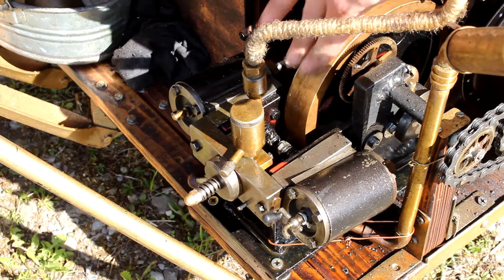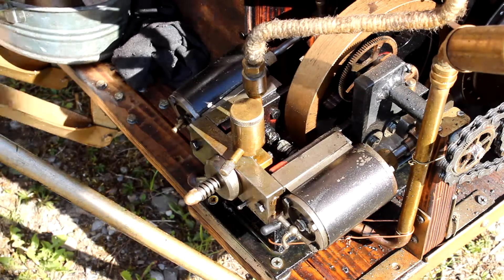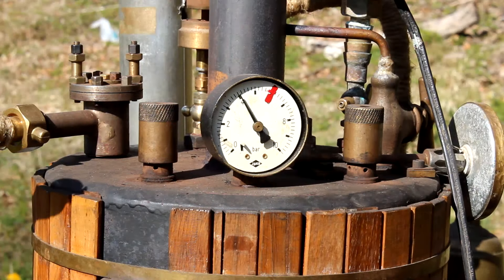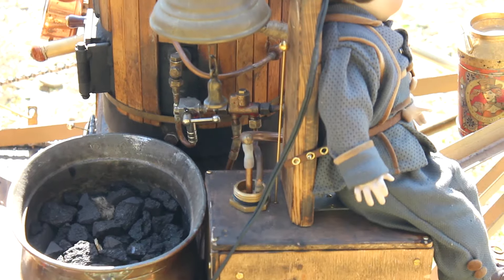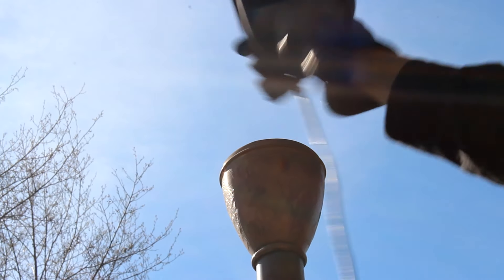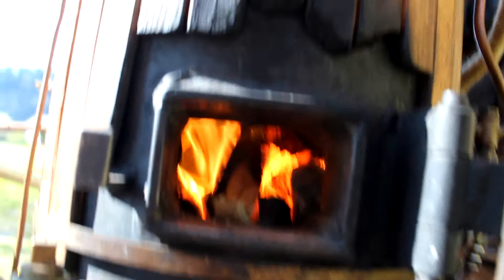Here we have two oscillating cylinders. The pistons get steam from the boiler when moving forward and backward. We've now reached about four bars, which is approximately 60 psi, so I begin to throw some charcoal into the fire to get a much hotter flame. After this, let's remove the electric blower and open the steam blower valve to suck a huge amount of oxygen through the fire, which makes the coal fire burn really hot.